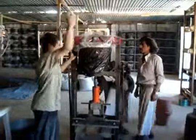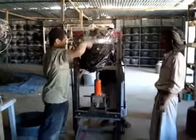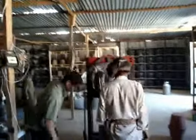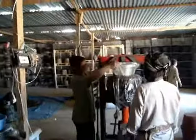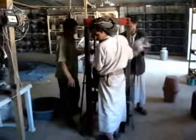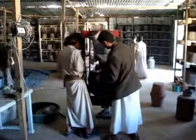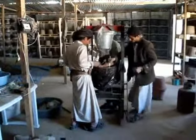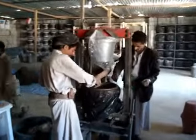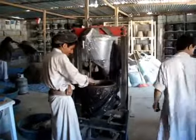This is quite an operation — we're pretty proud of ourselves right now. And it just released. That was a pretty quick turnaround on this one. One thing we learned is you have to stamp the filter while it's still on the press. Some filters were being stamped after they came off the press, and we were getting a little bit of a bent rim on the top, so we learned our lesson.